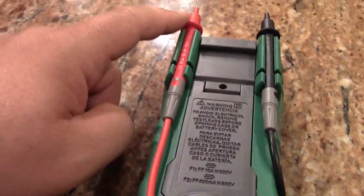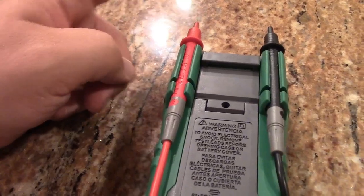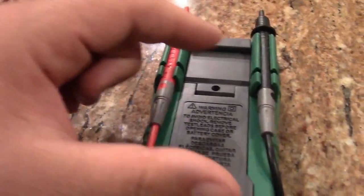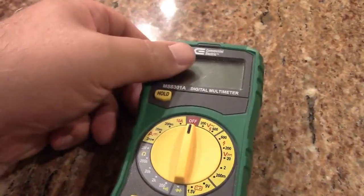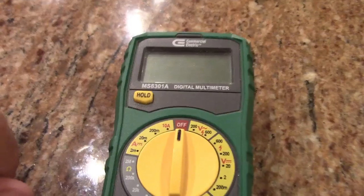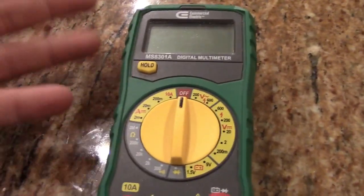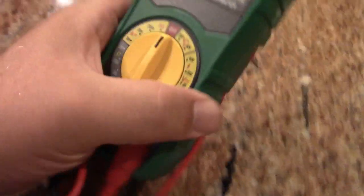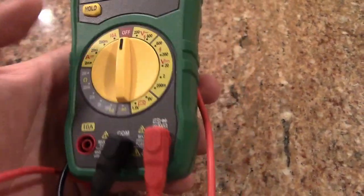Using the meter leads, I held one probe on one end of the fuse and the other end to a standard double-A battery, and we read nothing. But hooking the battery up at one and a half volts, everything was perfect. I had to MacGyver that solution to find out what the problem was — and the fuse has since been replaced and the meter works properly.